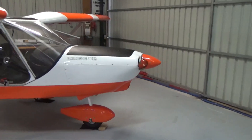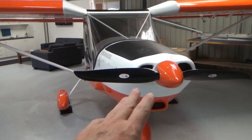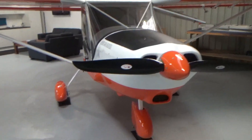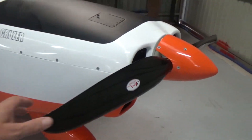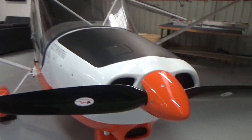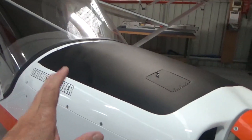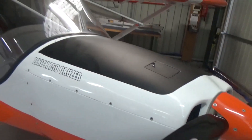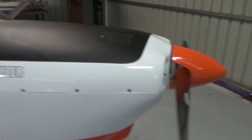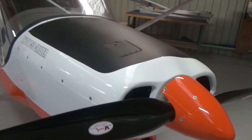I'll start at the front here. I haven't had much prep for this video but I'll just talk as we go around. The propeller — I took two degrees of pitch off the propeller just to give me a bit more RPM and unload it a bit, because it is a draggy airframe, like you can just see that compared to my Jabiru all-moulded airframe. That seems to improve things, helped with my CHT and EGTs. We went through that.